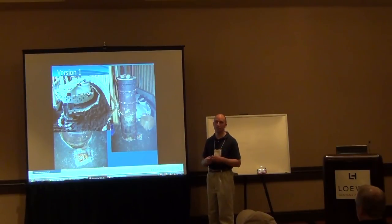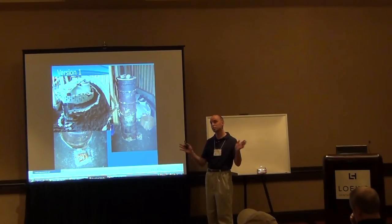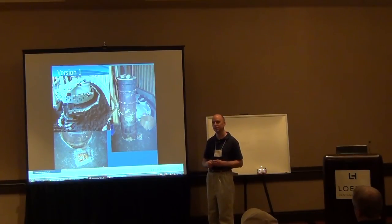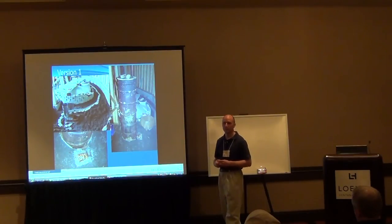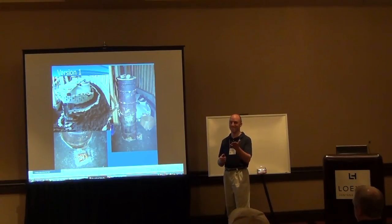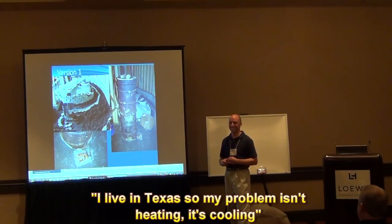But like I was saying earlier, there are some people I've seen who've run some fairly long ductwork through the entire greenhouse. That's why they usually split it several times. That 8-inch duct, they split it four times. You've reduced the friction through the system and slowed down the flow rate through there. So yeah, you can run it longer. Do you have any other questions? You have some great questions, so if you have any others.